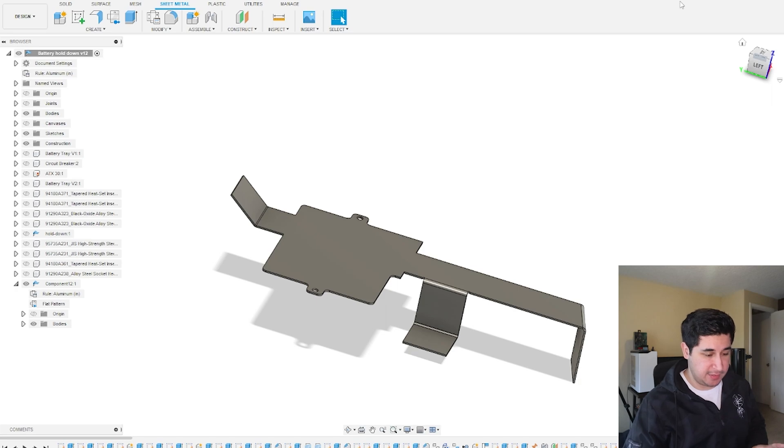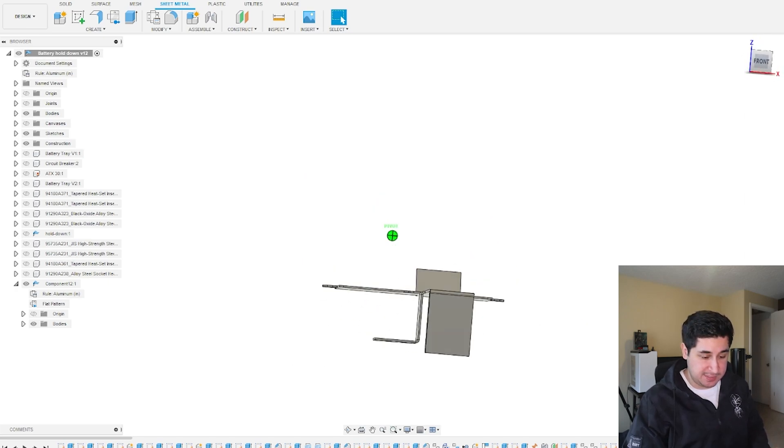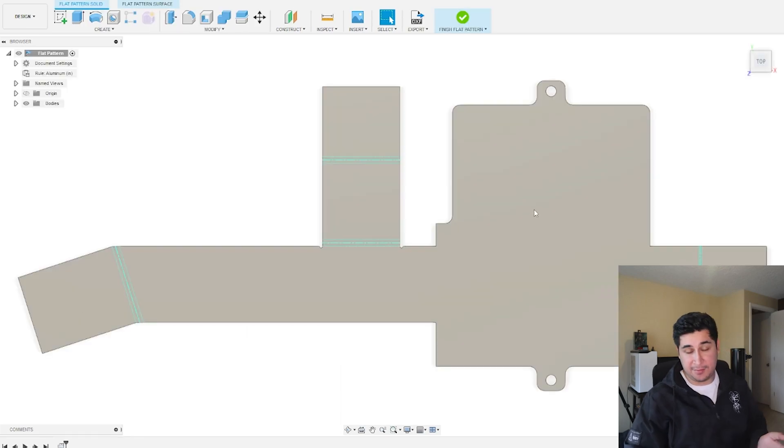The tricky thing is that a lot of these bends have to be pretty precise and sharp — most are close to 90 degrees or slightly more or less. In Fusion 360 I can make a flat pattern and print it out to scale, then transfer that to my piece of aluminum, cut it, and mark all my bend lines. The issue is I have no way of cleanly bending any of this, so I've got to come up with a solution — I think that's going to involve making a quick dirty press brake. Let's get back to the shop and see if we can do it.